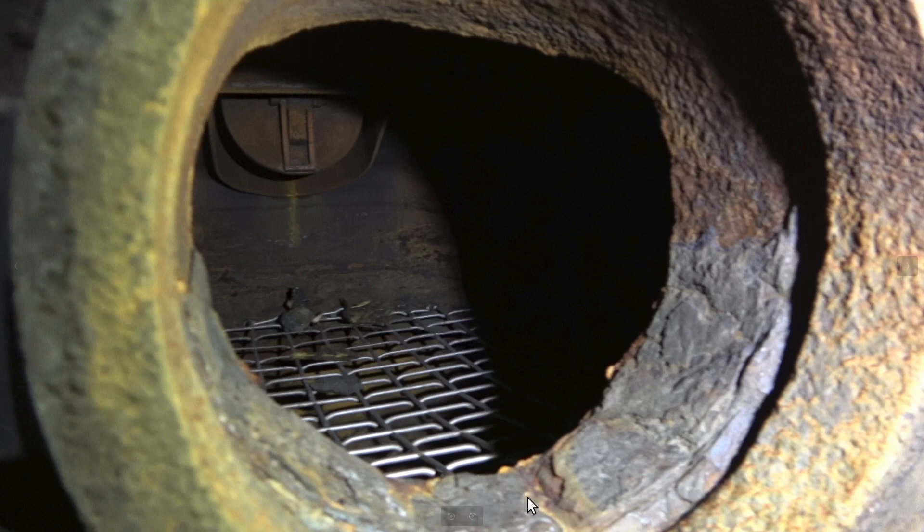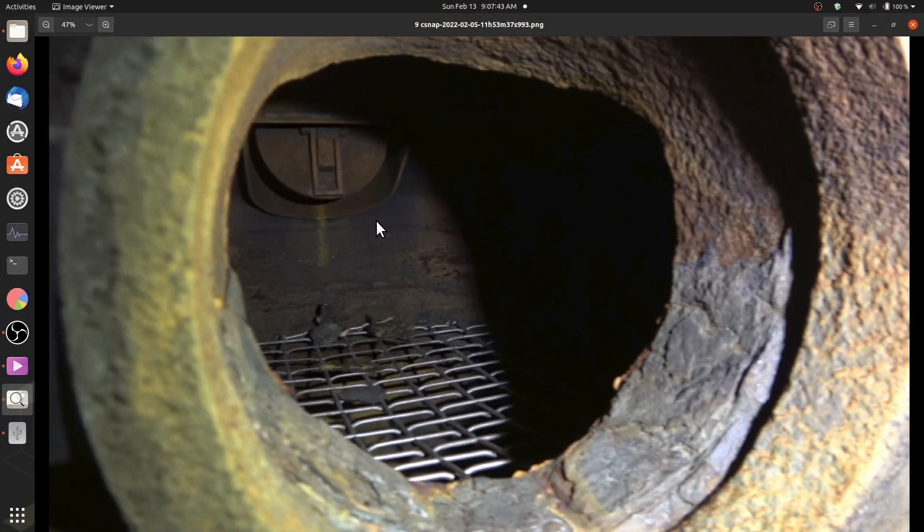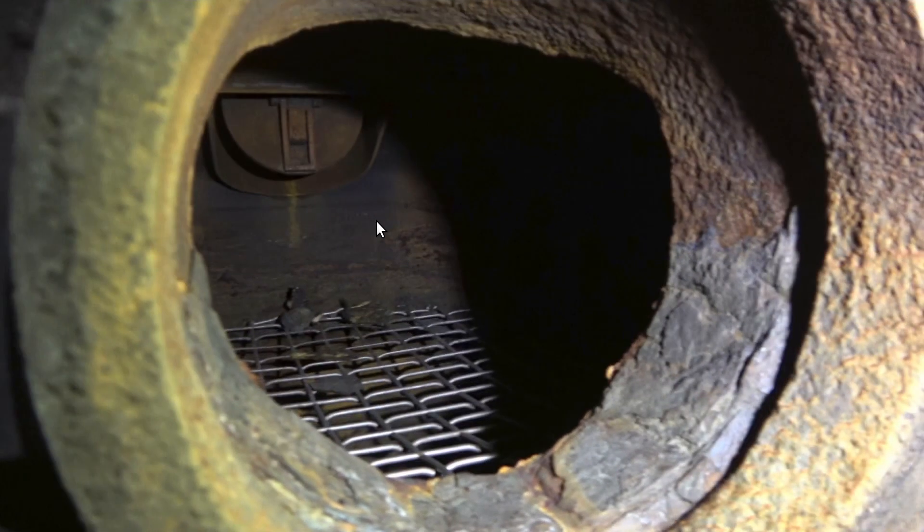Here's inside the pyrite hopper showing the flop gate. You can see a few rocks and some debris in here. These will plug up really fast if you get dirty coal or a lot of debris builds up. They'll actually start backing up the chute into the air part of the pulverizer and start smoldering. So you'll have to open up the door and blow this thing out occasionally, or keep the screens clean.